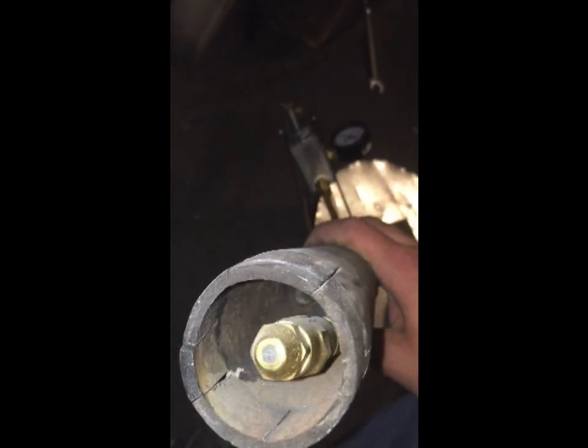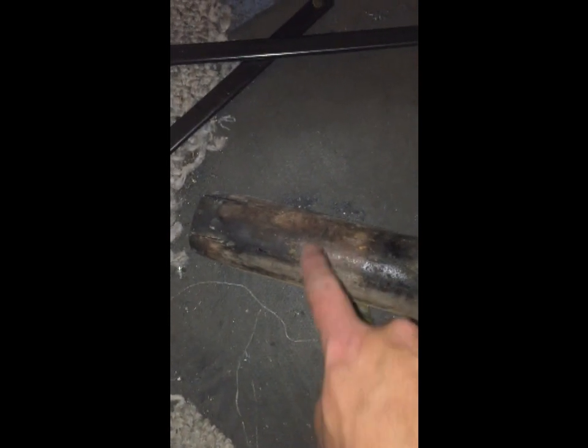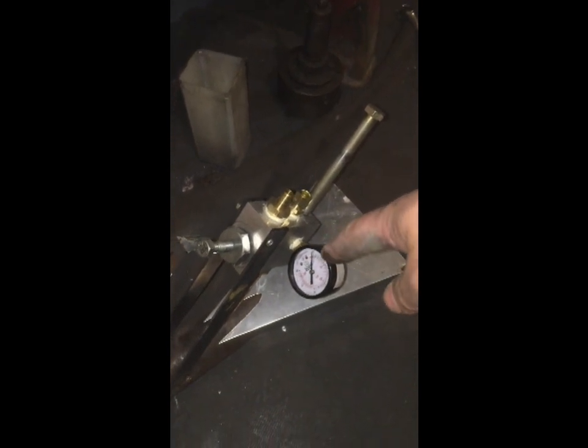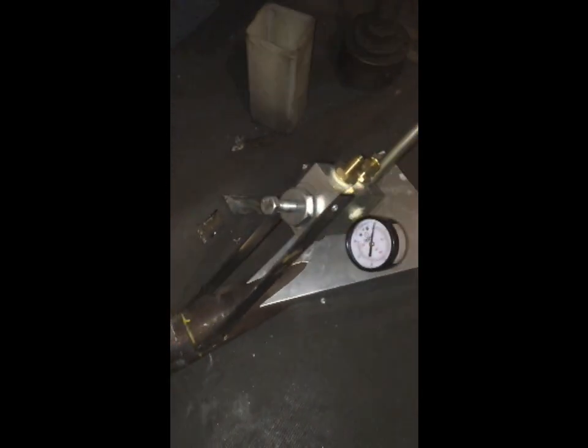Okay, so if you look down this tube right there, you've got the atomizer at the end of that oil tube, which kind of skirts around that restriction there. The bleed air that comes out of this is supposed to do a final heat on the pipe and oil before it atomizes and goes out for combustion. So that's the idea there. This screw sitting out the back of this thing is a throttle valve, and after the oil has been pressurized to 15 psi, that's going to control how much of that pressurized oil will reach that nozzle. So that's what that's for.